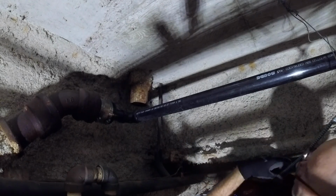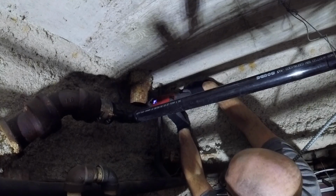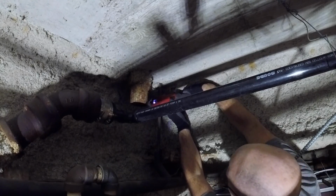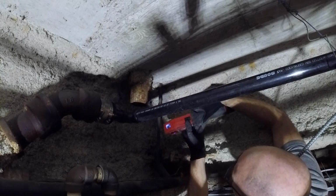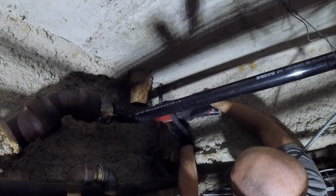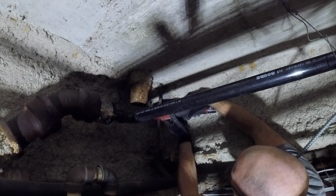Here is where I'm tapped into the cold water for the sink below. We're going to rough cold water line in from above, and for the hot water for the hand sink, we're just going to put in a little under the sink water heater to be able to wash your hands as per the health department. So that's why there will be no hot line roughed in here.